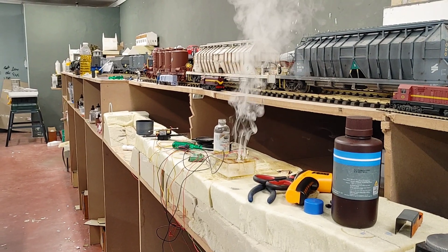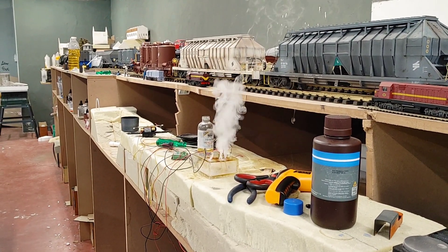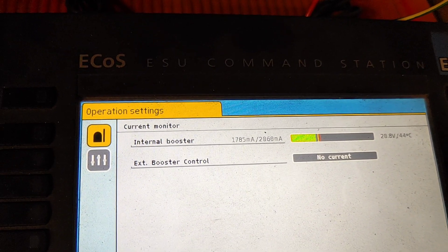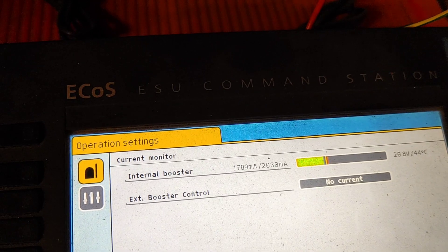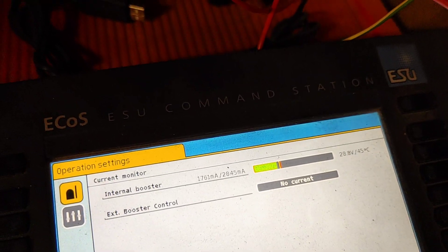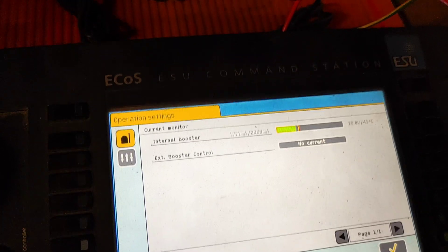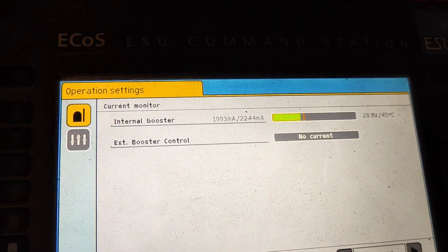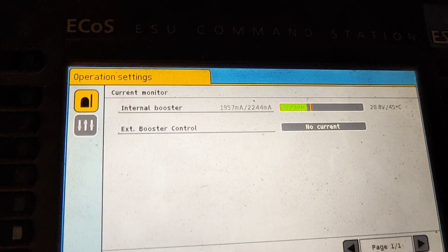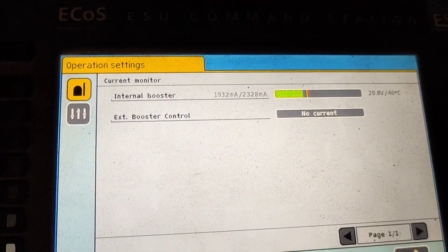We are running on a low pulse, pressing a very efficient 1,788 milliamps — about 1.8 amps — which is a hell of a lot better than 3.2 amps. Now if I bump it up so it runs consistently at heat, we're at 1.8 to 1,912 milliamps, and that's the hottest it's going to get. The rest of the amps it picks up is from the little motor I've got attached — a little HO motor — just so the decoder knows where it is.